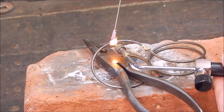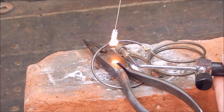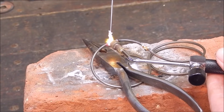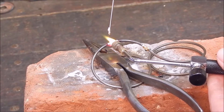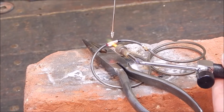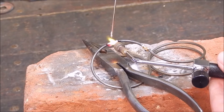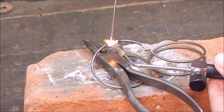Put on some flux. Now we'll put on the bronze. It looks to be working quite well. See, if you go too hot you're going to oxidise the steel. I'll give it a good coat — good broad covering. And when you braze, always use the metal to melt the rod. You don't use the flame to melt the rod.